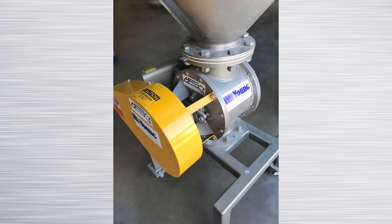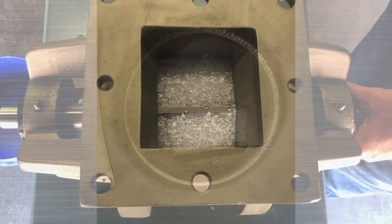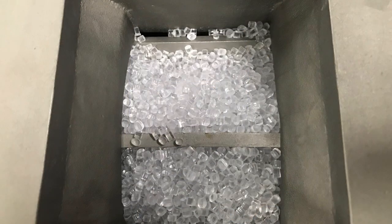This is a vertical drop-through rotary valve with a pellet flow inlet throat and rotor that eliminates clipping of the pellets as they enter the rotor pockets. In a conventional drop-through rotary valve there's a point where the rotor will clip pellets on the downward side of the inlet throat.